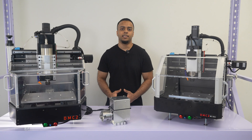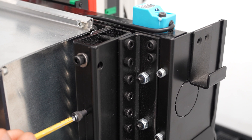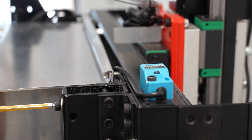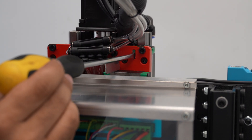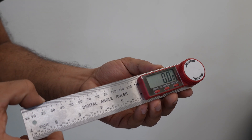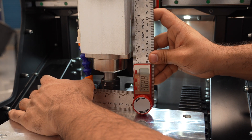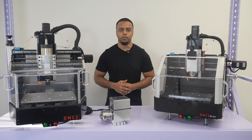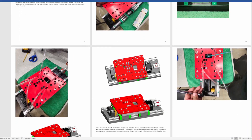To solve the tramming issue, the frame is intelligently redesigned to have a jack screw system that tilts the entire top end to nod forward or backward, and left or right to adjust the XY and YZ axes after you build the entire machine. The ZX axes are adjusted from behind and tightened into place, all using a digital angle tool accurate down to within about 0.05 degrees. This means you can truly slap this machine together with no concern for alignment during the build, adjust everything when you're done, and anyone regardless of skill level will have a well trammed and accurate machine.